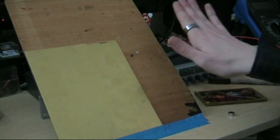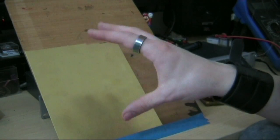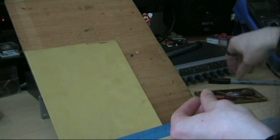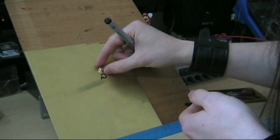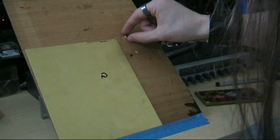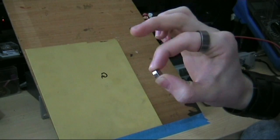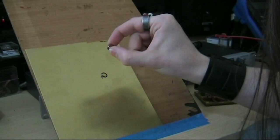I'll demonstrate it for you — this is really cool. What I have set up at my desk is a wooden board on an incline, and I've also got a brass sheet which I use for cutting out the base plates for my humbuckers. Brass being an electrical conductor, when a magnetic field comes into its region it's going to generate eddy currents — little currents flowing in little circles. Wood, however, does not conduct electricity so it can't generate current. If I take my neodymium magnet and place it on the wood and let it go, it's going to be dragged down by gravity and falls at the rate you'd expect. But if I place a neodymium magnet on the brass sheet, because eddy currents are created and the magnetic field opposes the magnet's field, something interesting happens.